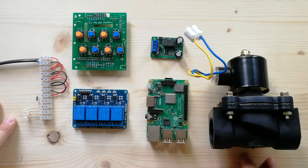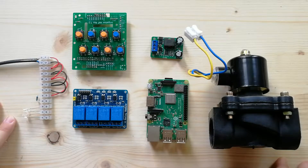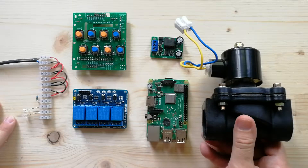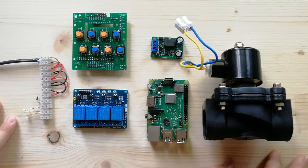The system with the relay acts as a switch, so there is no specific requirement for the valve and power supply, except that the valve should be normally closed. There are two types of valves for irrigation: normally closed valves, which as the name says are closed when no current is applied and open when current is applied; and latching valves. This system is not compatible with latching valves, in which one impulse opens the valve and another impulse or current closes it.